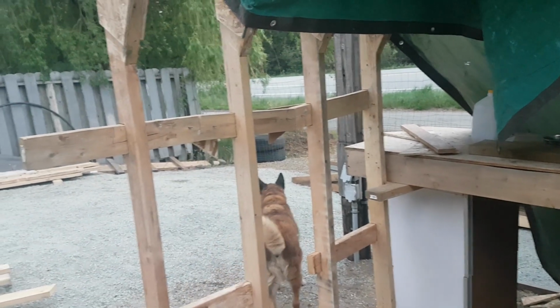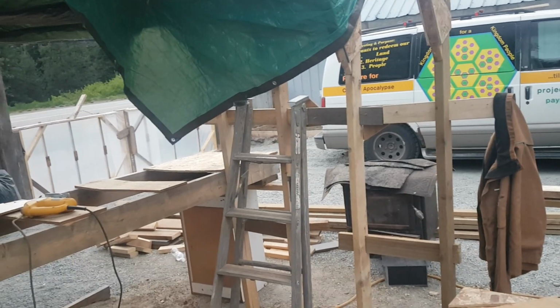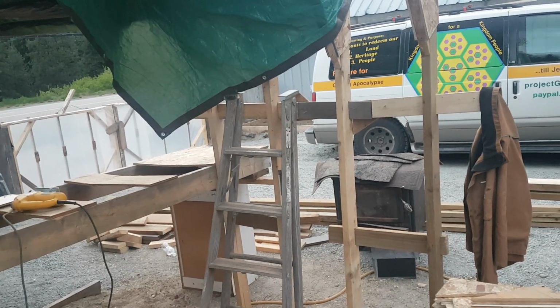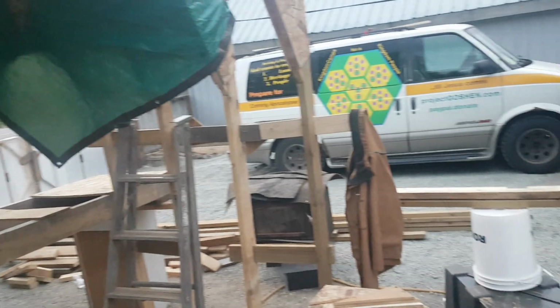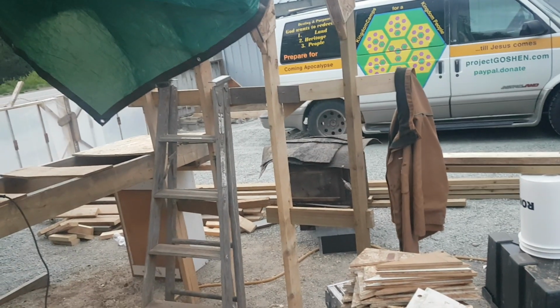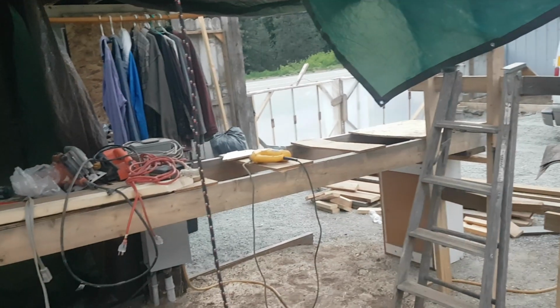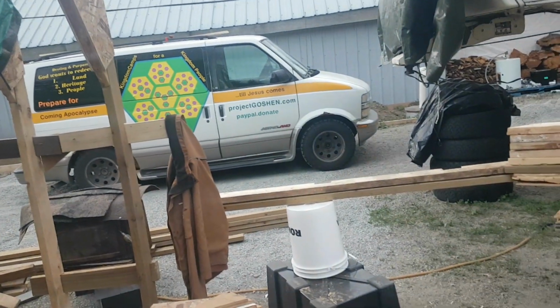Inside it's going to be 70, 75, and there are different things you can do to bring in the outside air and cool it. You can add ground tubes that go into a dry well. When you pull your air, it cools down to about 55 degrees, and then it comes inside. So there are different things you can do. Old technology. This is not new.